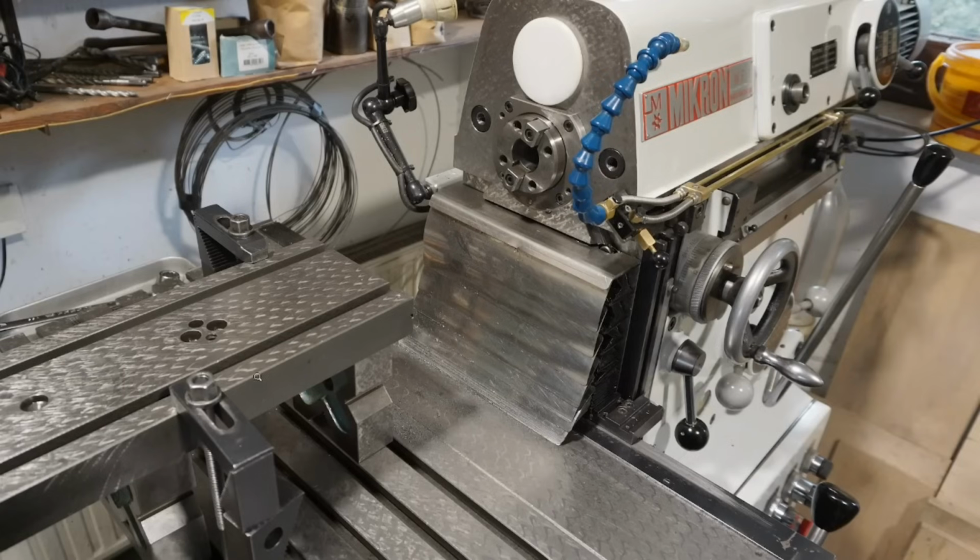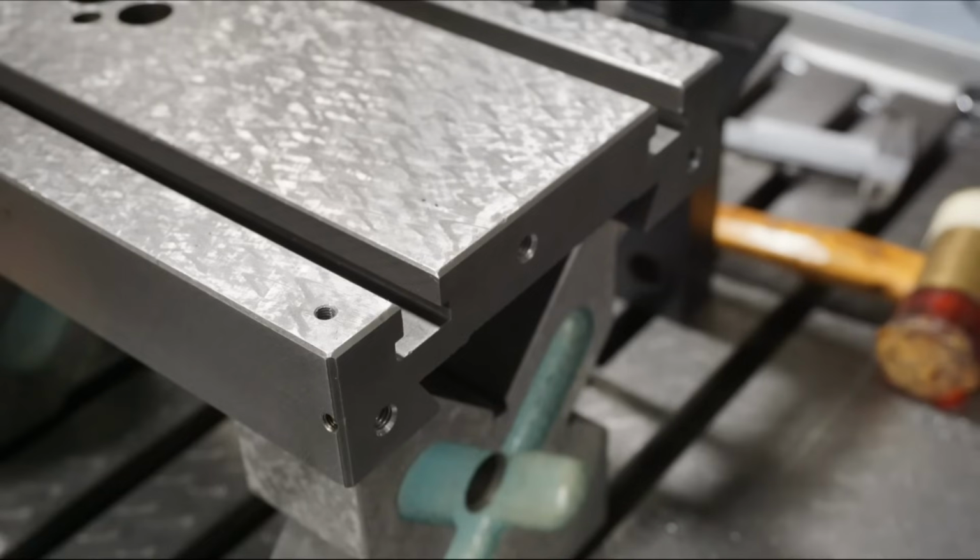So I had these holes also EDM drilled, and in order to avoid positioning error, I pre-drilled those holes as well. You see 1, 2, and 3 here already drilled and tapped for M6, because I will fit lubrication fittings directly to those holes.